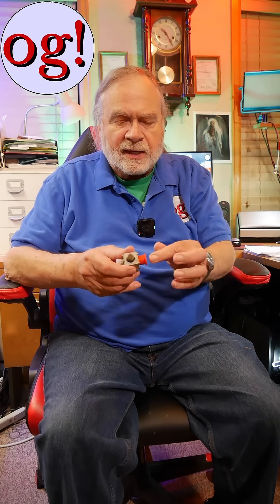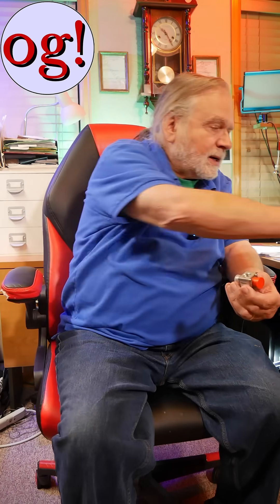I've got a lightning arrestor right here that I keep. It's got coax coming in the end, the side connected to ground, and the actual spark tube is inside — it's this little thing right here. Now, that thing is designed to fail shorted. So if it's shorted, it will short your cable, and then you just go looking for the lightning arrestor and see if that's where you have your short.